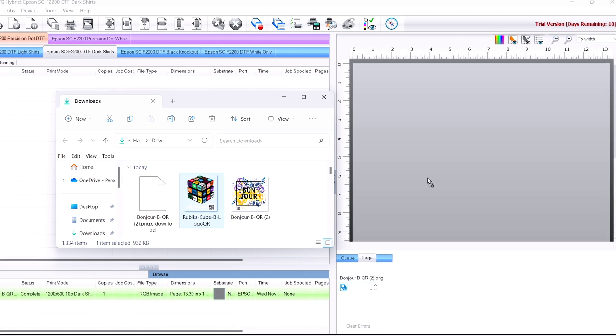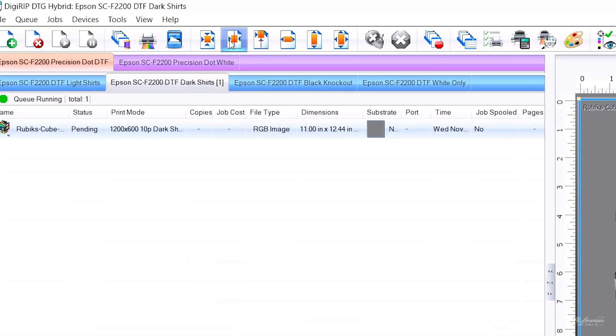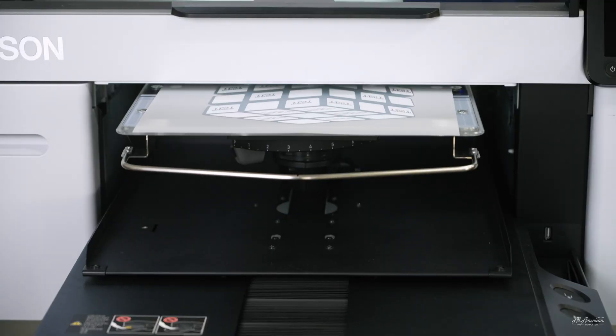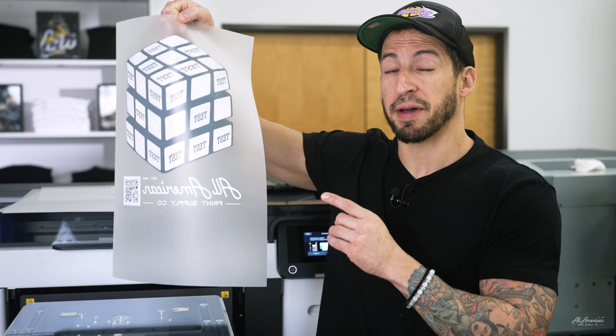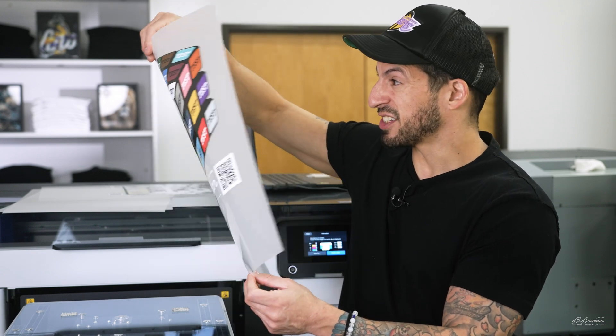Let's bring in the Rubik's Cube again — it's an 11-inch wide graphic for this image. These buttons up here give you different options for positioning where you want your image in the software, so we'll go with center horizontal alignment. Now immediately on this print, I'm seeing a little more visibility of the color layer underneath that white overprint. That's because DigiRip Hybrid is really optimizing the amount of white ink needed, not wasting anything. So if we're saving time on the print and saving ink on the image, we're saving money. Let's go ahead and get these powdered and cured so we can show you a full comparison between the two programs.